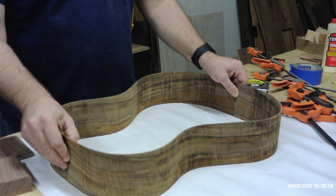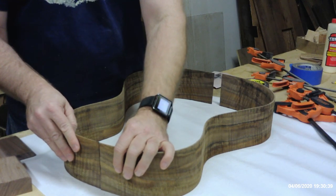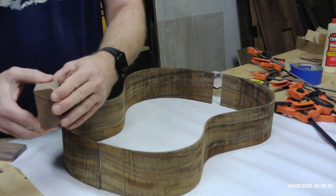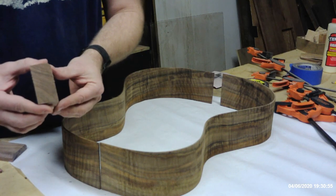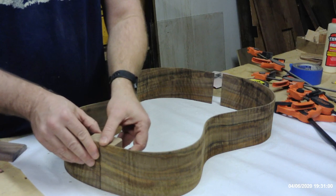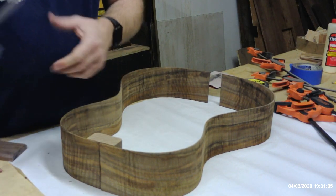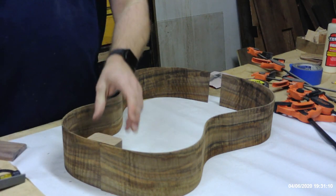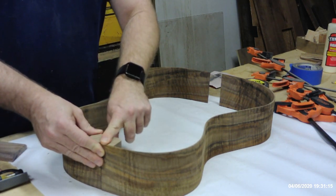Now we're going to assemble them — first, we're going to dry fit assemble them. Notice when they fit together, they're going to butt together. I've cut this block — it's just 2 and a half inches wide, with some chamfered sides to look nice, and it's the height of those sides. In this case, these sides are 3 and three-quarters to 3 and seven-eighths. So that's the size of the block — it's flush on both the top and bottom.